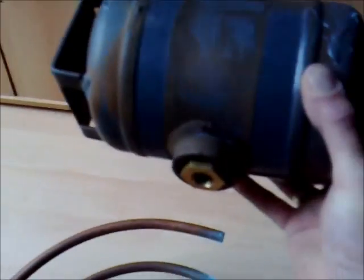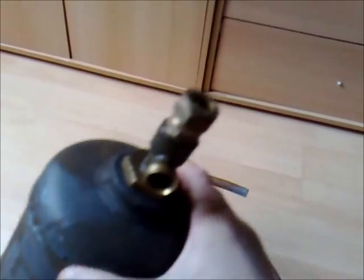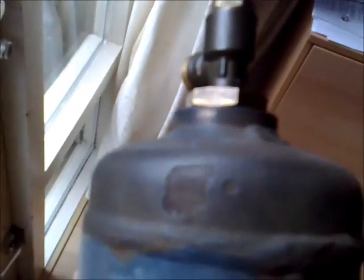I've got this little length of 12 millimeter copper tubing for the desuperheater. I got a small air tank that actually comes from a train — it's about one liter and I will use this as the tank for the liquid air. I'm a bit afraid to use it because it's already a bit oxidized and I'm not really sure if it's safe to use an iron tank with liquid air. As we all know, iron will oxidize faster — it will rust faster if it gets colder. So at minus 200 degrees with liquid air and oxygen, it might actually become an aggressive reaction. Maybe anyone has any input on this — I really appreciate it.